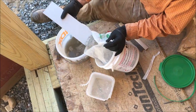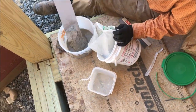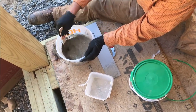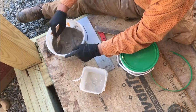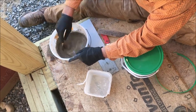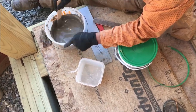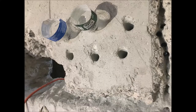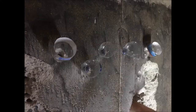We're mixing this stuff up — I'm making a half-batch here, and I'm going to speed up the film because I know this is boring as hell watching an old man stir grout. Usually you're doing this in a vertical position, and typically I drill three-quarter inch holes every five or six inches apart. You are recommended to use larger holes, but this is a horizontal application, so I'm using little water bottle caps to try to funnel this stuff in.